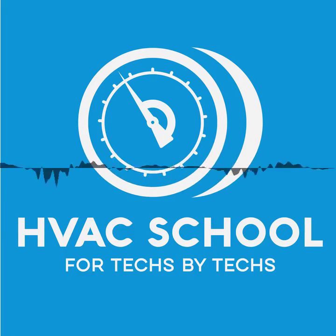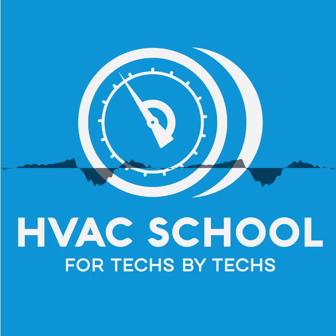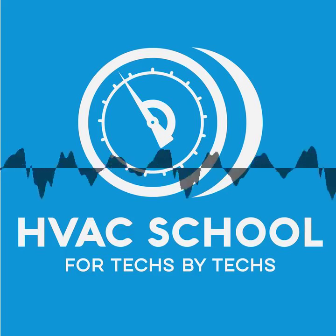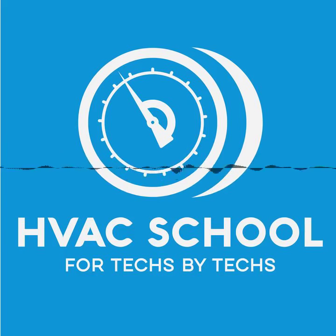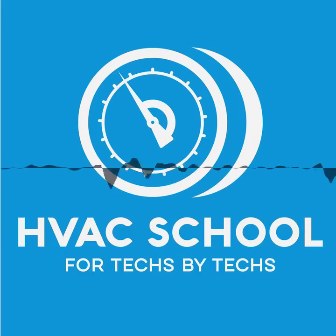When AccuTools decided to get into combustion analyzers, MeasureQuick tied it in as a diagnostic app that actually does combustion diagnostics. The software side is the toughest part of the business — it requires a ton of work, maintenance, and upkeep. What's been seen consistently is a bunch of lackluster apps that let you connect and see readings, but maybe just calculate superheat or subcooling without going to the next level — showing not only what the readings are, but what they should be, and what combinations of readings mean for system diagnostics.